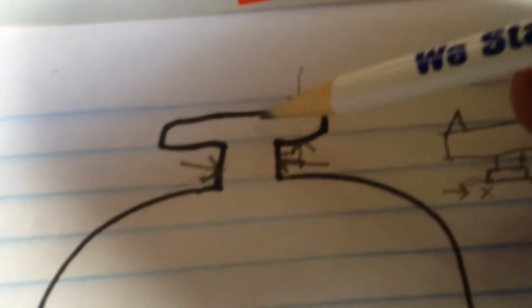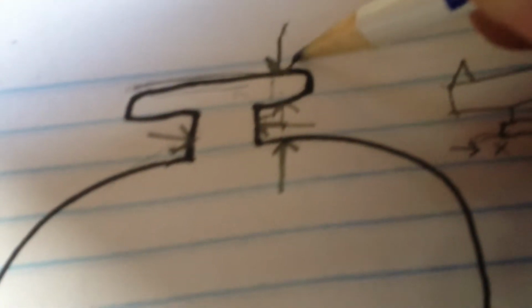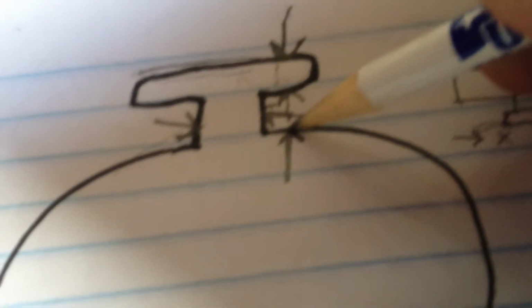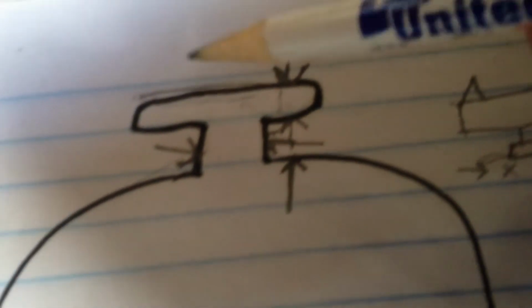So, starting here, you're going to want to start grinding. See, here's the thing. You immediately want to say, well, if I need to make this part smaller, the easiest thing to do, this is flat and it's right in my face, let me just start filing this down, because then it'll fit. The problem with that is that the space between here and here has to remain constant. You cannot change that, because the bottom of the bayonet, the part outside the slot, will contact here. That's part of what makes it fit right. So if you start grinding away here, you might not have any effect at all, because it can't be relieved here; when it's being seated, it's up against here. Does that make any sense?